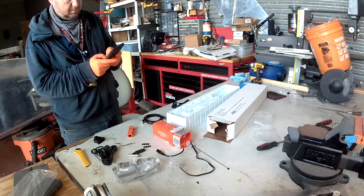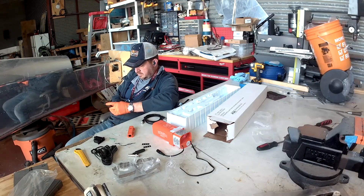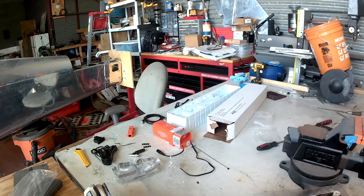It's a simple wiring system. It does have a big old battery in that orange box you see there, but it's also rechargeable. There's 12 volts that go in and out to help recharge the battery and keep it fresh. It also has a line going into it from your GPS source, which will tell the ELT your current location — and that will actually be sent out with the packet of information along with the blaring siren that goes off. Which is pretty cool.